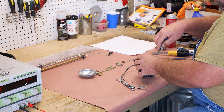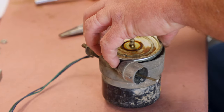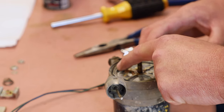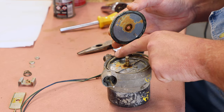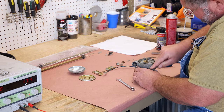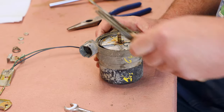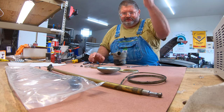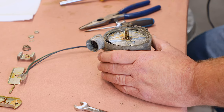And this is the cover for the drum. And the cable, the nylon cable from the antenna, comes down here. And there's little bumps on this cover, and that's what pushes the cord into the housing where it's stored. Usually if the motor's running and the antenna doesn't move and you can pull the antenna up and down, it's because the cable's broken. So this is the gearbox now.